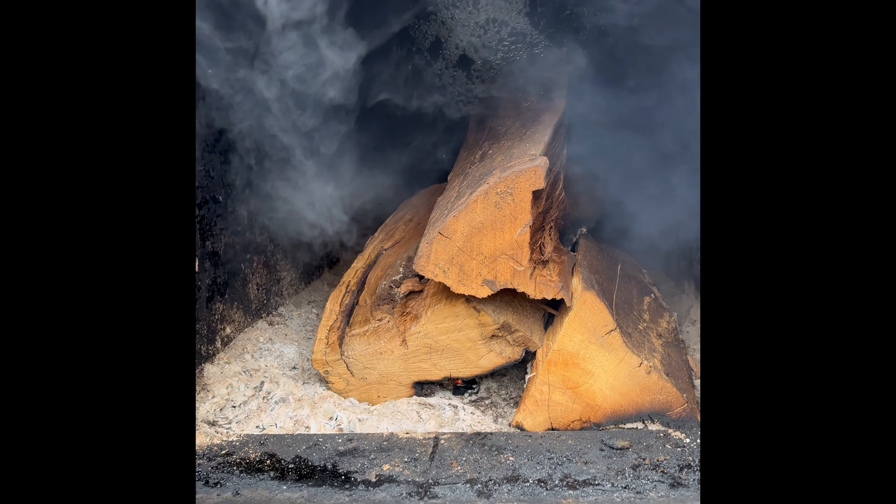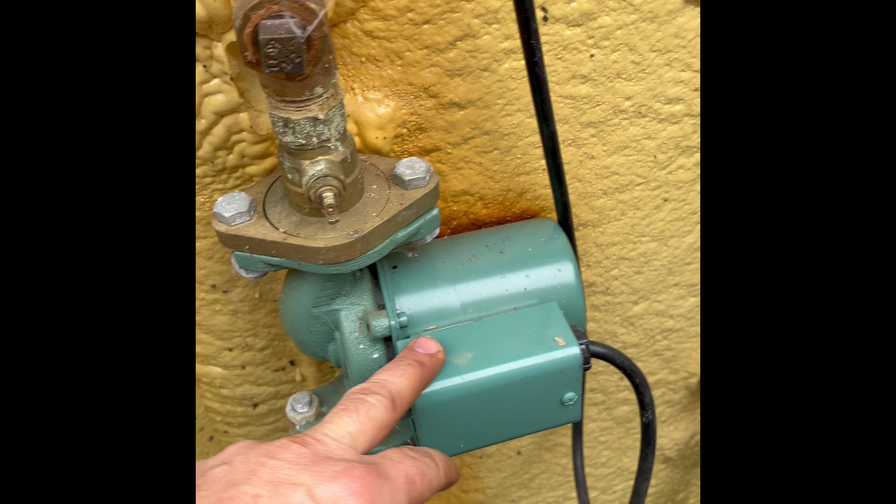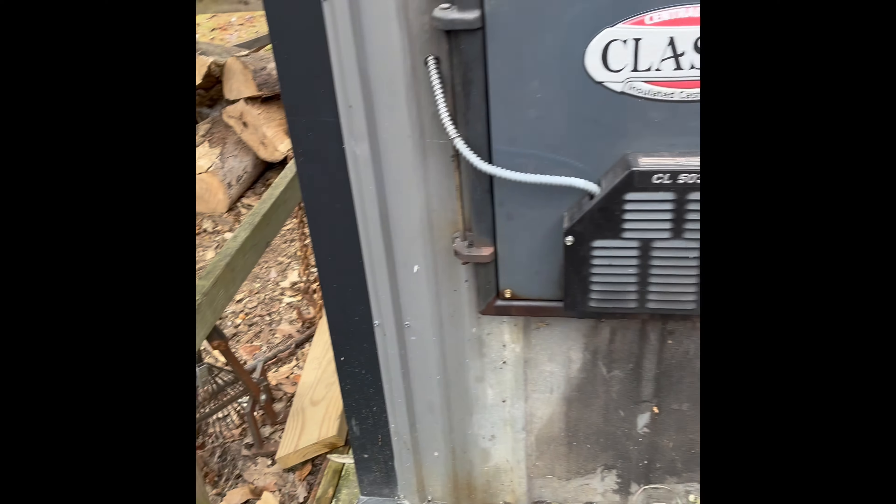For those unaware, why we cut so much firewood is we've got one of these boilers — it's actually not a boiler, but it goes by a boiler name — and we heat our home and we heat our water with this unit, through heat exchangers. It's got a firebox, and then an outer box, and all in between is water. Your heat heats the water. The water is pumped into the home through these little Taco pumps, through insulated pipes, into the house, where we have heat exchangers in our air handlers.